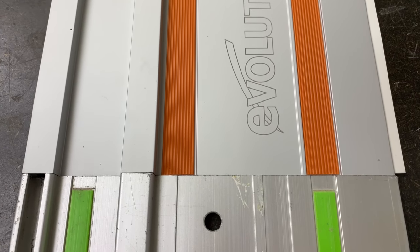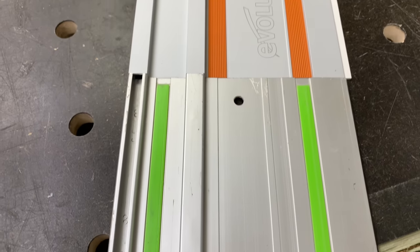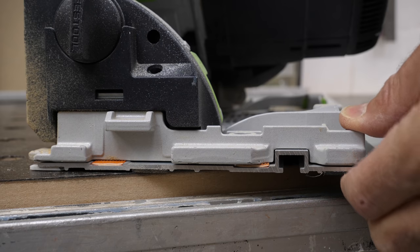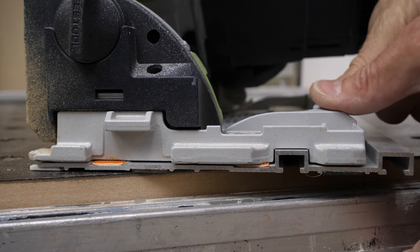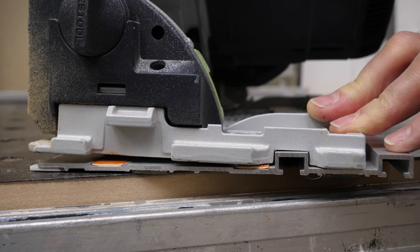What can't be readily changed are the low-friction glide strips. In all other rails these strips are located either side of the main rib, but with the Evolution rails they are both to the right of the rib, between the rib and the splinter guard. I've never had a problem with this, but it does mean that if you're in the habit of leaning on the front left of the saw in use, you could tip the saw over a bit and mess up the cut. I found it did take quite a decent amount of force to achieve this, but it is possible, and I was made aware of the issue by a subscriber who'd been having real problems. So it is a real thing — if you've experienced any problems with this using your Evolution rails, please let me know.